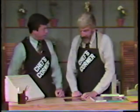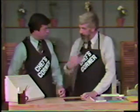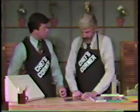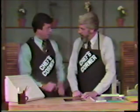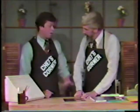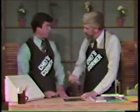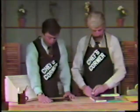What would they be caused by? Pinholes in negatives come from processing, come from dirt on the lens and the camera, and so on. But in essence, they're like little holes where you don't want them. Right, in a solid area or something like that. And if you can see through them, they will image your plate and would then consequently pick up ink and print. So you don't want any of those pinholes. All right, so we want to get rid of the pinholes. How do we get rid of them?